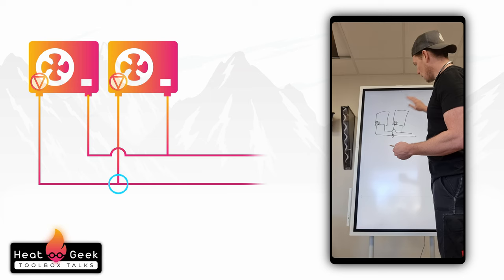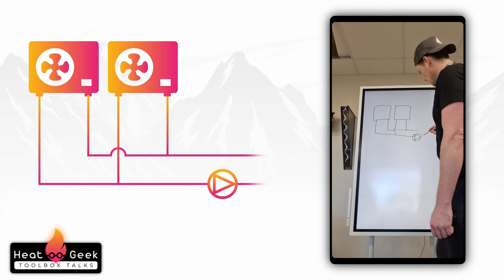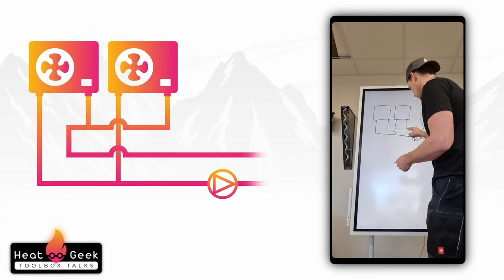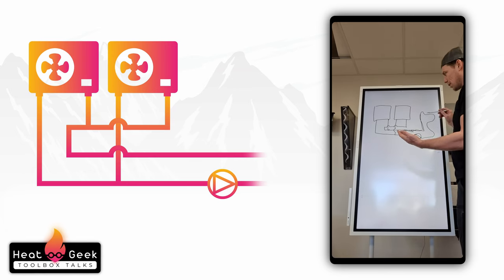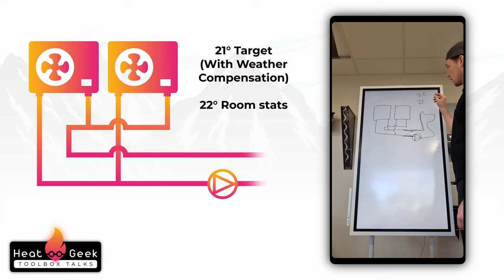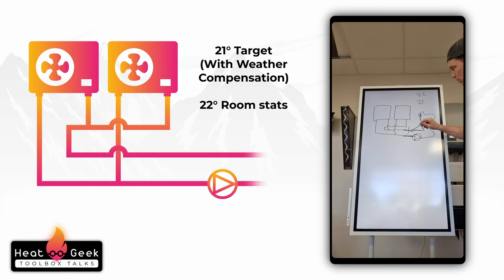However, if instead you had two heat pumps without internal pumps, I don't see why you can't stick one large pump on the system, provided you've got enough head, and have it running around the circuit and back. If it's open loop only — if we're not over-zoning and we've got good volume in the main large pipe work — this should be reverse return. Provided we've got enough volume, the correct control strategy (target room temperature 21°C, weather compensation, room stats set to 22°C so it has room to move), they should run absolutely fine. When it goes into defrost it needs to get around the radiators, so you'll want all zone valves open.